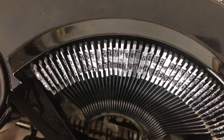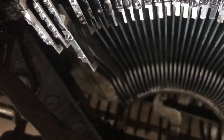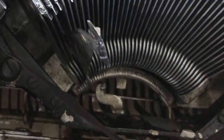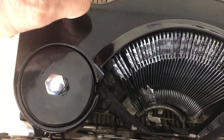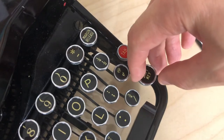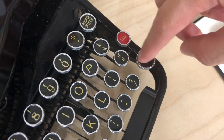One thing I notice about this particular machine is that the typefaces are reasonably clean — we'll scrub them out anyway. In this case they're angled rather severely; the ones on the ends are almost like a hatchet face, and that's to account for them striking the platen straight on. I've never seen that this pronounced before — kind of interesting. Also, the decal on this right shift key seems to be peeling away from the metal ring. It might be some kind of celluloid, so I want to be very careful about how I address that.